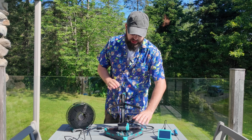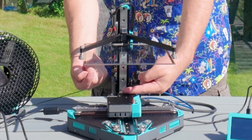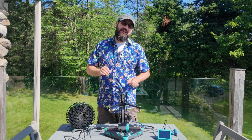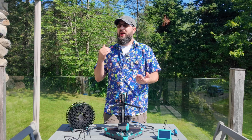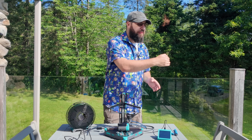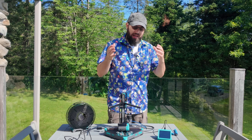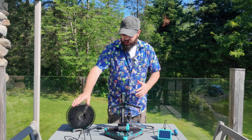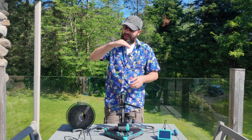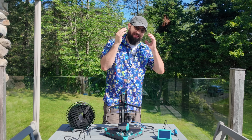Also, because of the nature of this style of printer, as you can see here, this tool head is extremely compact. The filament is coming in from the side and the nozzle is pointing up. This has a 90-degree bend in its filament path. If anyone's ever done any work with AC ducts or anything like that, you know every time you bend the flow, you're going to lose flow. So by having the filament path do that 90-degree bend, it adds a bunch of complexity. While it is functional and works pretty well with PLA and similar filaments, one thing you absolutely cannot run on this printer is anything abrasive, because as that filament hits that 90-degree path, it is just going to eat away that turn and cause a lot of trouble.